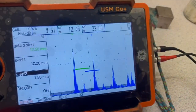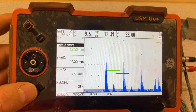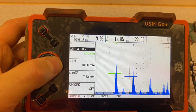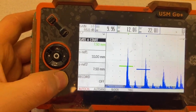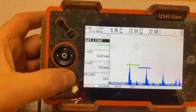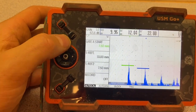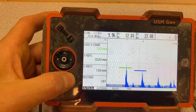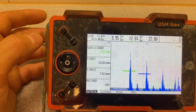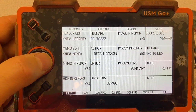Open 10 - now we see the signal. We put a gate on the first signal and set it to 80 percent of the screen. Now it's 80 percent of the screen. If we change now and press here for two seconds, press here - yes, right here - and it's automatically 80 percent because in the settings it's supposed to be set like that.